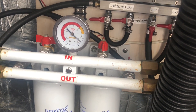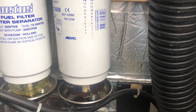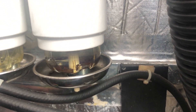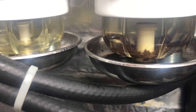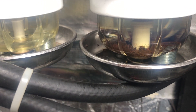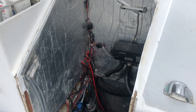As well as checking the sail drive oil, it's also a good job to check the oversized fuel filters. One's in use, the other one's spare. Okay, we've drained it out. There's a bit of debris in the bottom but there's no water. Right, I suppose we can close up now.